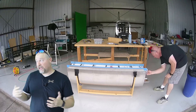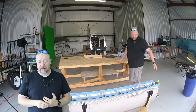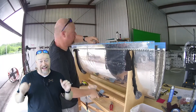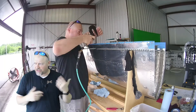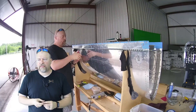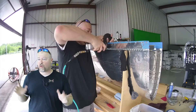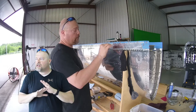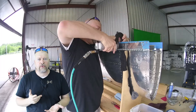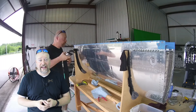That's one tank — it's sealed. I've gone through and looked at areas where I thought I needed more ProSeal and put a little goop on there just to make sure. I'm going to screw in the various connectors, the fuel cap, and all that to physically seal it, and put a finger of a glove over each of the holes so no nesting bug gets in — the last thing you need is a mud dauber making a nest in there. I'm going to let the ProSeal completely set for three to five days, then test it by pressurizing the tank to about one pound of air and seeing if it holds.